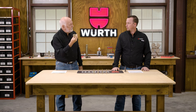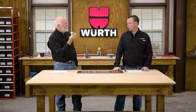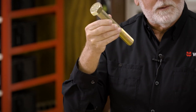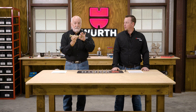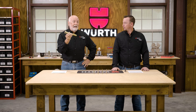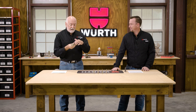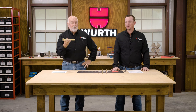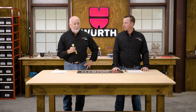So Aaron, is this a bolt or a screw? I'd have to measure it to be sure, but I think that's a screw. That's correct — what I have in my hand right here was manufactured as a screw. Now can I put a nut on here and use this as a bolt? Absolutely, yes. But can I take a bolt with its loose tolerances on the body diameter and head and use it as a screw? Not necessarily — you probably shouldn't do that. So you can use a screw as a bolt, but you shouldn't necessarily use a bolt as a screw.